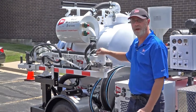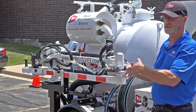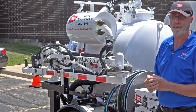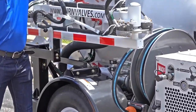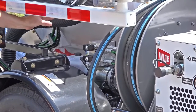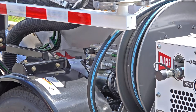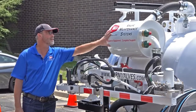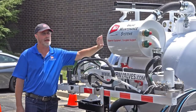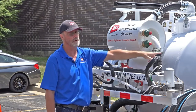The heart of any valve maintenance trailer is the valve machine. On the standard LX, you get the ERV 750, which gives you 13 feet of reach and up to 750 pounds maximum output torque. Under the ERV, pinched between the fender and the spoils tank, is an electric-over-hydraulic power unit — a 12-volt DC power pack that runs all the necessary functions to dump your spoils tank and open the rear door. Above that is your filter assembly for the vacuum system, with two quarter-turn latches, a canister inside, and vacuum reliefs on the front to make sure you don't exceed the rating of your vacuum pump.